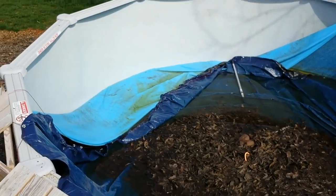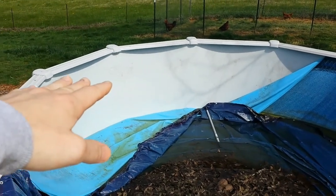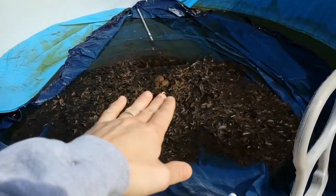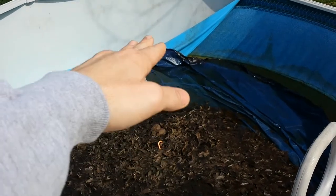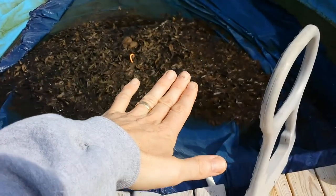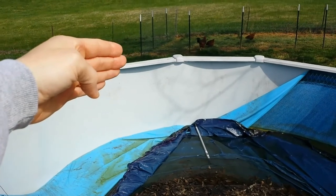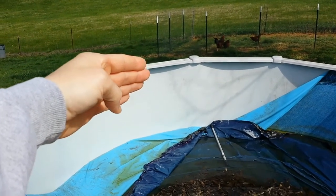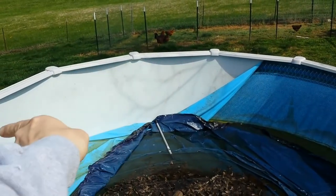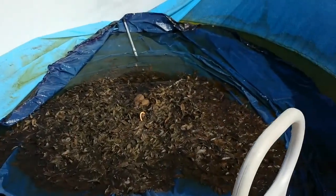Not knowing it, because I still had the pool cover on — it's been working great, by the way, you couldn't ask for anything better. But because we had the pool covered, you couldn't really tell where the water level was inside the pool. The water level on top of the pool cover had been building up and pushing it down as the water level was going down. So what happened was that wall got pulled in about a half inch, just leaned in — you couldn't ever have told by looking at it — but just enough to allow the liner to slip out because of all the weight on it. And we had a minor catastrophe yesterday.